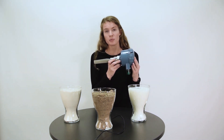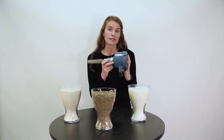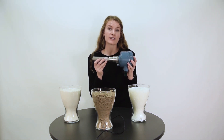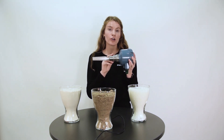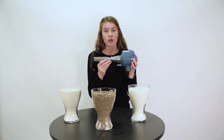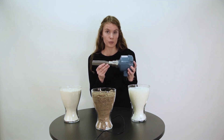The working principle of this device is that when it is connected to a power supply, the fork tines are driven to vibrate at their natural frequency by an internal piezoelectric crystal. When the fork tines are submerged in a solid media, the vibrations are completely stopped.